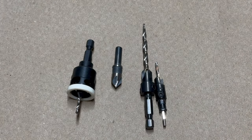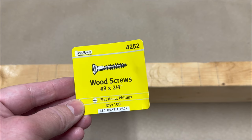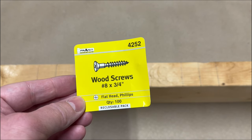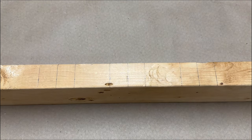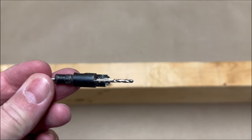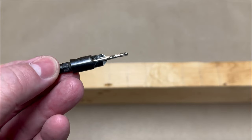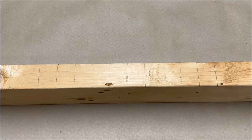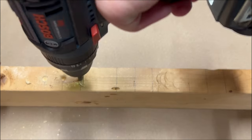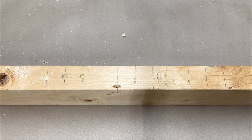I'm going to be drilling to insert some wood screws — number eight by three-quarters of an inch — just to be consistent. The first one I'm going to use is this style with the pre-drill pilot hole bit and chamfer cutting portion for countersinking. I got three holes there. Now let's put some screws in.